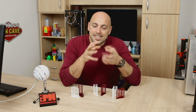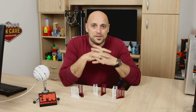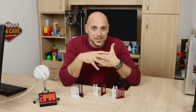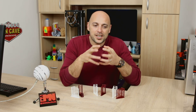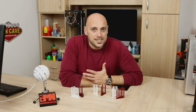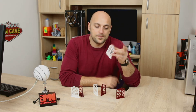Now every filament needs different retractions and this can be quite a headache to figure out. While I've had my fair share of fails when it comes to retractions, I figured I wanted to find a simple and easy way to tackle retraction for each kind of filament I used. So what I did was I took the idea of my temperature tower test and I created a retraction tower test — and that is this little model right here.